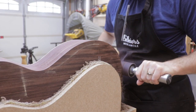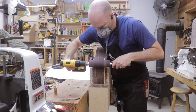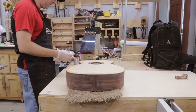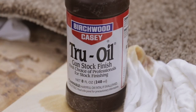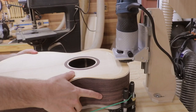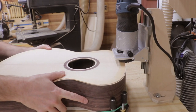I also made a carriage to hold the sound box while sanding, since it's difficult to hold in a vise because of its shape. The carriage is lined with carpet and did a good job. Before cutting the channels for the binding and purfling, I put on a coat of Tru-Oil around the edges of the soundboard. This helps prevent little fuzzies from forming from the router bit and also helps prevent the glue from staining the light-colored surface.